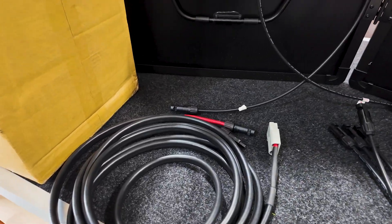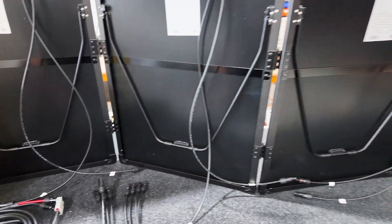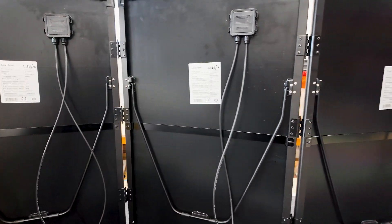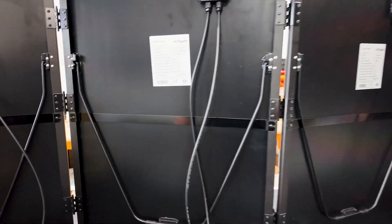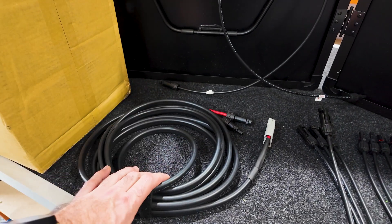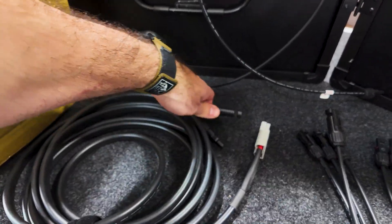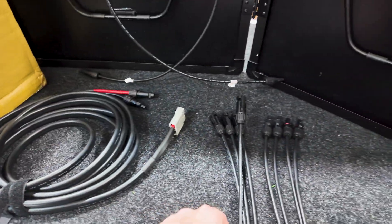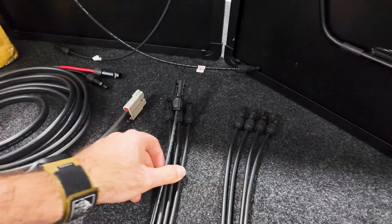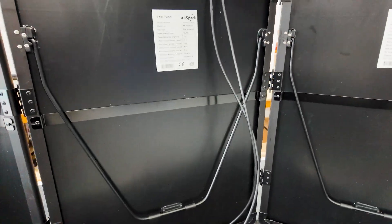You're going to wire up your quad fold in a full parallel setup. You've got your panel laid out — you can have it standing up or laying down, ready to go. The cables are long enough to reach. To do this you're going to need your 5 meter Anderson to MC4 connector, your four-way tail adapters in both positive and negative, and obviously a 400 watt panel.